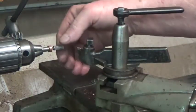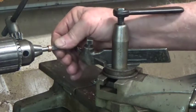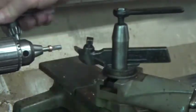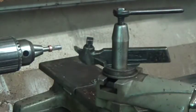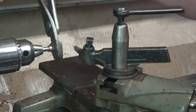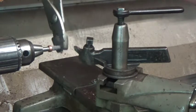So I'll get that whole deal inserted into the chuck, then I push that back tight against that collar. Now I'm tight against the chuck jaws. And I tighten the key pretty tightly because I want to grip that shaft nice. And then I just take a little pair of slip joints and I'll cinch it up. So I can turn these and they won't spin on me.